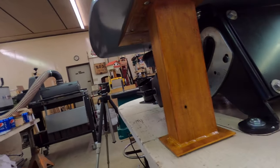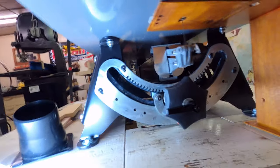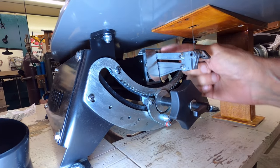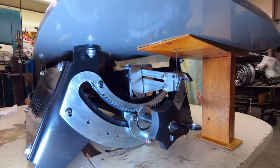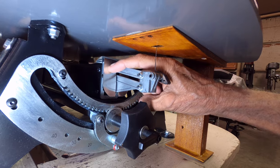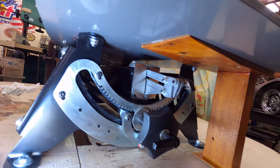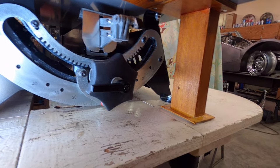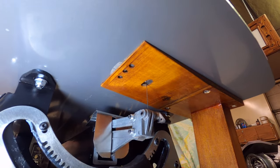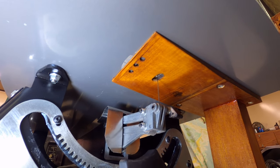Underneath, in case I don't use dust collection, I added a little sheet metal baffle. I took the blade guard off under there — that leaves two screw holes at the top which I used to screw the baffle on. What that does is keep sawdust from dropping down into the bearings on the arms. It stops most of it anyway, to help keep those bearings cleaner so they should last longer. I also drilled three holes in the end just past the holes in the plate to let a little more air in there, which I think helps.